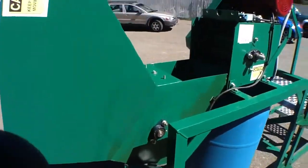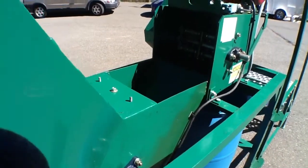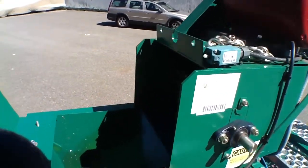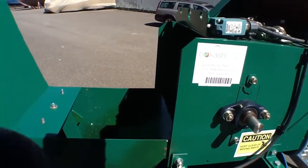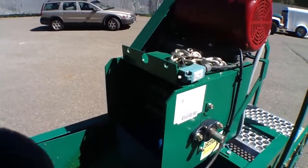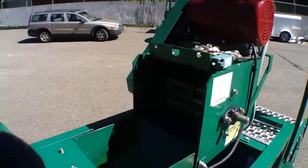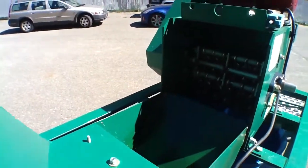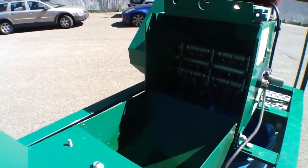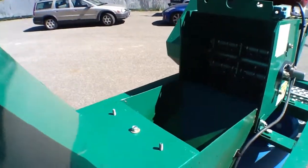It's Dr. Larry Green taking a close look at the anatomy of a Bokashicycle food waste pulverizer. Every machine comes with its own barcoded serial number and our contact 800 number. Here you can see a machine that's electrically driven, single phase, 3-horsepower electric motor. We have a thrashing box, and you can see the chains that are used in the pulverizing activity, and a hopper with feeding wheels.